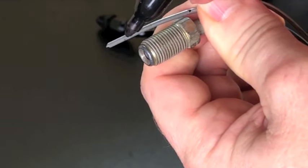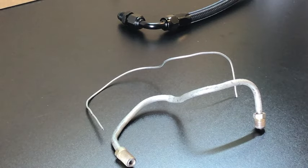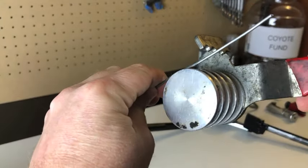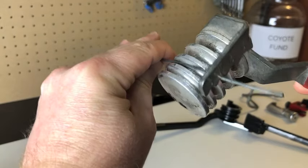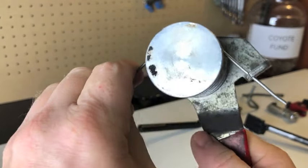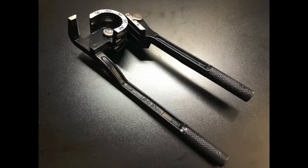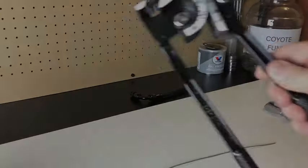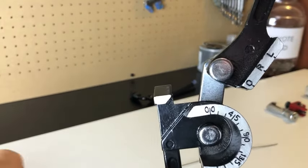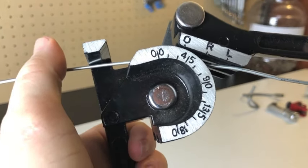By marking it and cutting it, wire can also be used to get the length. There are several different tube benders, so I'm going to show a couple that I used. With this one you'd put the tube in the right slot and then just bend it over by hand — you might want to start with some wire to get used to it, but it makes really nice bends. Here's another one which I really like — it has another handle for leverage when you're pulling it over, and also has degrees written on the side to show you where you can start and finish.